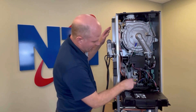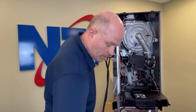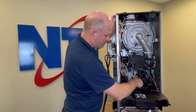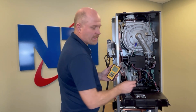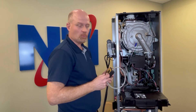The next step is to go to your gas valve, remove the test plug, and loosen the bottom test port — this is a Torx T10. Loosen it off a couple of turns, take your manometer, stick the tubing over the test port, and take a static gas pressure reading. You're also going to take another pressure reading once the boiler is up and running.